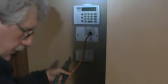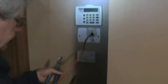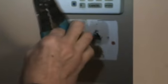What we're going to do now is wire the new wire that we pulled down to the furnace. We're going to wire the new wire to the thermostat that we have, all right? So you give yourself a good fudge factor here. We don't want it under tension, because if it's under tension, it'll pull right in. A lot of guys like to strip this wire that way, but I don't like doing that because you tend to get into the conductor. So what I do is I take the pliers and I strip it like that. Okay?